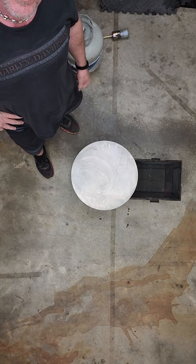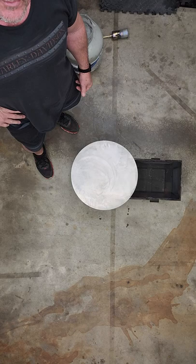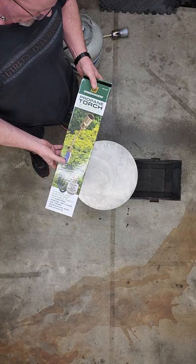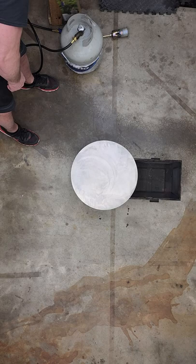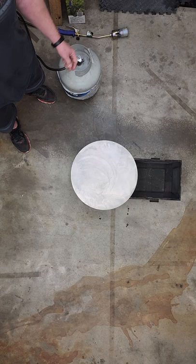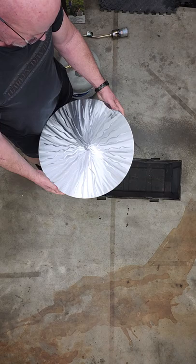I'm doing a basic video — I've got this hanging from my ceiling in a box, nothing fancy, going a little OG here. The problem is nobody shows you how to flame paint online very well, so I'm going to show you a little bit of basic flame painting. Real simple, real basic tools. We're going to use a regular propane torch — a propane burner you can get at Harbor Freight for $29 — hooked up to the propane like you get from your grill. No fancy oxy-acetylene torch or anything. We're going to take basic 18-gauge cold roll steel. It starts out plain like this, and after a grind, that's the design ground on it. Now we're going to put a little flame paint to it.